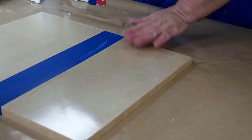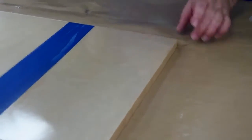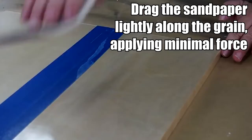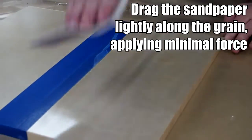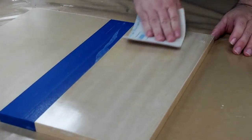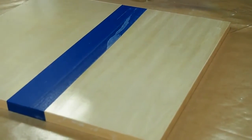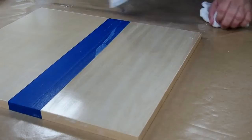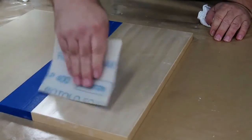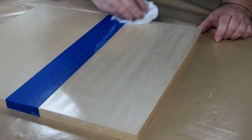Allow approximately 10 to 15 minutes for this surface to dry before moving on to the next step. You'll know when it's time to move on when the surface is not sticky to the touch. Use the sandpaper to make smooth sweeping strokes across the surface very gently — just drag the sandpaper lightly along the grain, applying minimal force, being careful not to remove too much of the shellac below. Take extra care to make sure you get all of the edges as well. Wipe off any dust with a clean cloth.